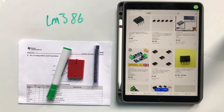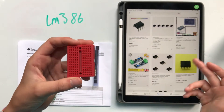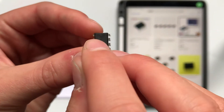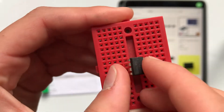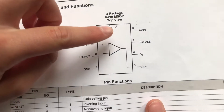There are DIP-8s and SOP-8s. They both have eight pins — that's what the eight means — but the DIP-8s are the ones you want to get because they'll fit into breadboards. The SOP-8s are really small and wouldn't fit on the breadboard. Here is one of the chips and you can see it has a little notch. We're just going to put it in the breadboard with the notch at the top.